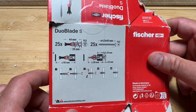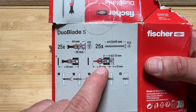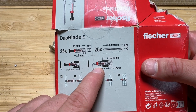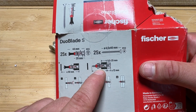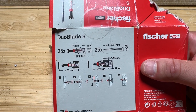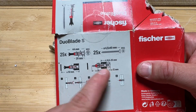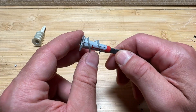It is cool how they expand. You can see that you push through — the metal piece has done its job, then you put the screw in, the metal piece drops out and goes wherever it goes, and you get nice expansion. You get a lot of security from that, which is pretty good. And you can't get it out of the wall — you just have to take the screw out.